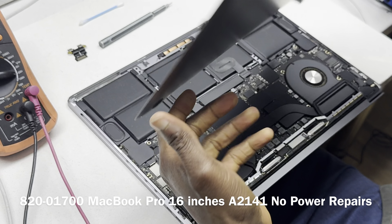There are three measurements we're going to make. First, we're going to see if we have a short on our PPBUS line using this fuse. After that, we're going to check for a short on our 2.5V line on the right-hand side using this inductor. On the 2.5V line on the left, we're going to use this capacitor or that capacitor.